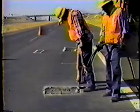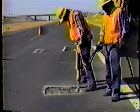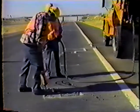Be careful when you cut the edge of the hole — make it straight, and most important, hold the tool vertical so your cut is vertical. Pay attention to the power you have in your hands: 200-degree hydraulic oil flowing at 2,000 pounds per square inch of pressure demands respect. Stay away from the hoses as much as you can, and always be ready for an accident like a hose breaking or a coupling coming loose. Stay away from the bit too. Protect yourself — wear steel toe protectors or steel-toed shoes, eye goggles, and ear plugs when using hydraulic hand tools. Don't forget the standard road worker safety clothing: orange vests. When operating hydraulic hand tools, use common sense, stay alert, and be careful.